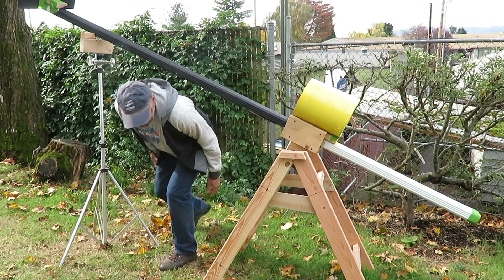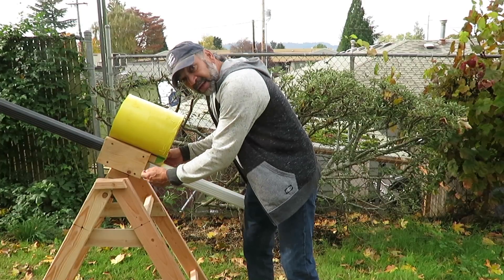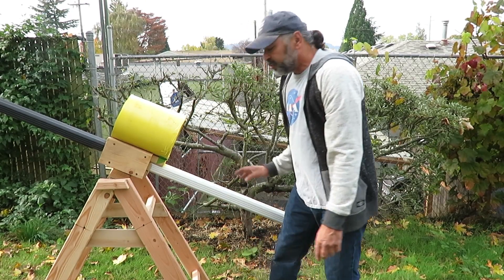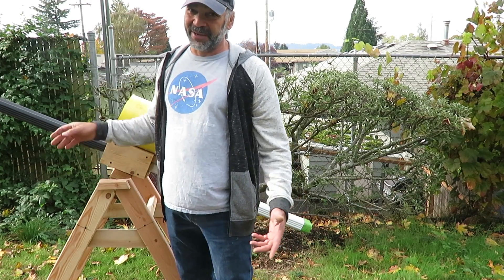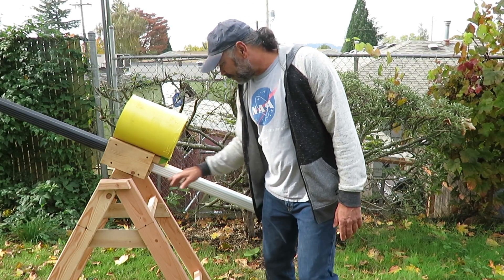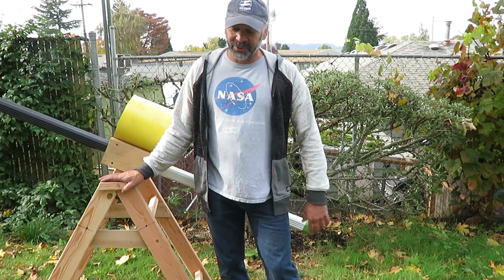One thing to keep in mind about the bottom part of the tube: I screwed a nail — a screw — right through the center into the gutter, and put a piece of wood in there to act as a block. Otherwise all the rocks you put in will slide to the front every time the gutter end goes down and make a big racket. I formed a block inside the pipe, stuffed it with rocks and brick, then taped it off. Now let's go into more detail — I'll bring the camera closer. Let's talk about the bottom part.